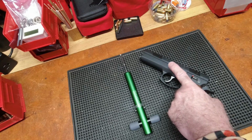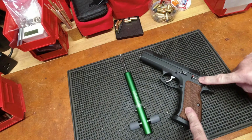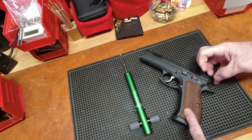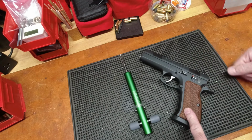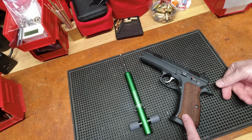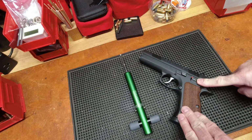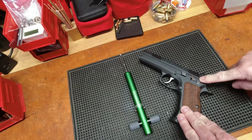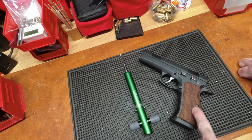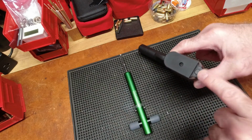And there is also a trigger spring. Then stepping back to the rear of the frame, when you pop the safety out, there's another spring for the sear, and that was an interesting method of replacing without losing a very, very tiny spring on the inside of that little block of mechanical wonder. Getting the safety back in is a challenge by itself, because there are gears in here that you have to align. And then the last spring was the hammer spring, which is right here behind the grips, and that was relatively easy.